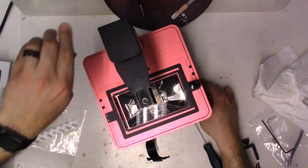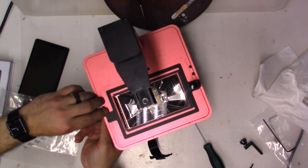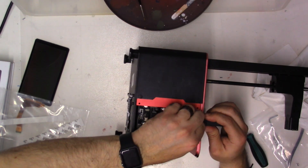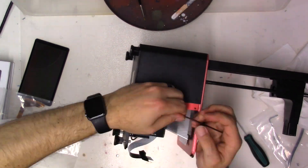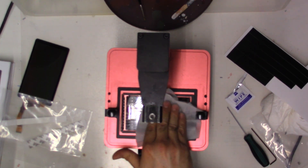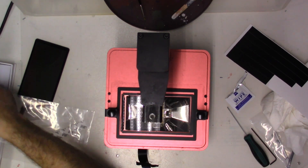So far this has been a pretty straightforward, simple process — so for anybody who doesn't think they can do this, I beg to differ. Surprisingly, these screws are plenty long for this. I'm going to hit this with some alcohol real quick and clean it, because you might have accidentally touched it and we don't want that going onto our prints. I'll use a glass cleaner wipe — your Elegoo Mars may or may not have a piece of glass here; mine does.